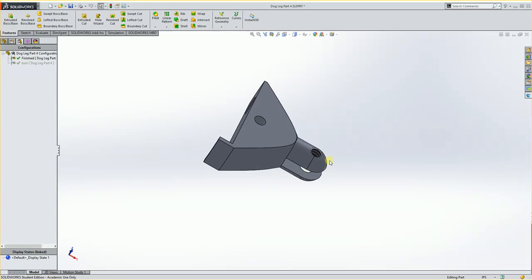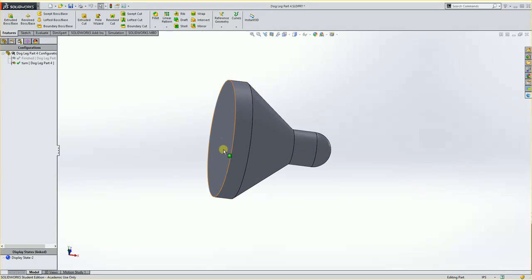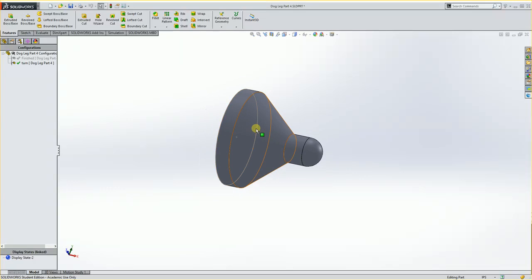First, we're going to turn the outside to look like this in the configuration. But actually not quite like this, because we need to add some material on the end that we can use to hold into a 4th axis rotary on a mill. So the solid that you have that was downloaded is not quite accurate to what we want to make. So we're going to modify the actual solid part before we actually start programming it.